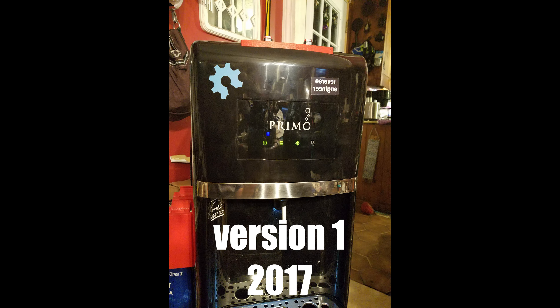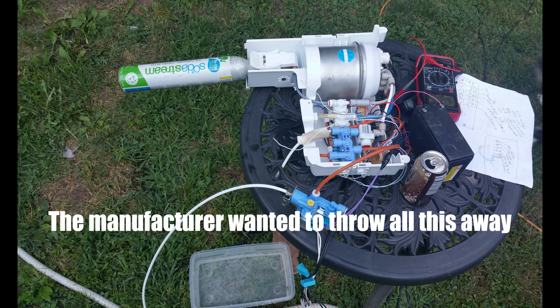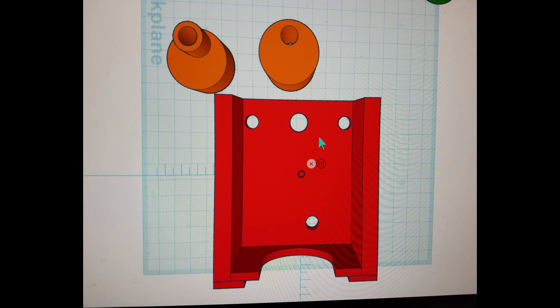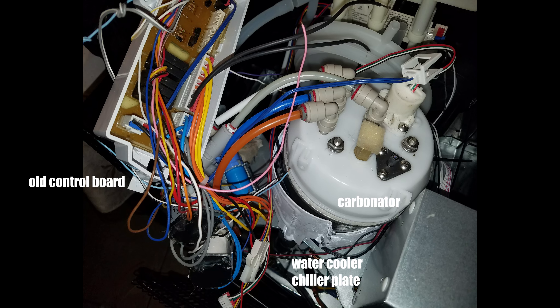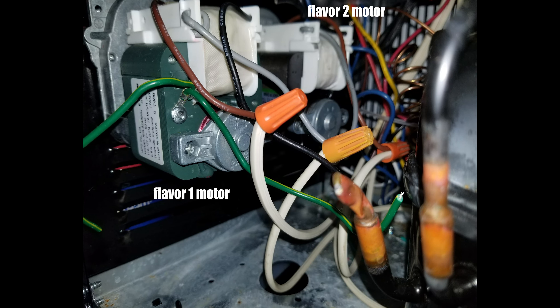The original machine was a converted water cooler. I made it with parts from a refrigerator that had a SodaStream module in it. I made the syrup pumps from store-bought pumps, adding a 3D-printed camshaft and an ice maker motor to pump the syrup. The syrup mixer was nothing more than a few elbows and some pipes. I installed the SodaStream parts into the water cooler and built some hardware to control the filling, gas charging, and syrup filling.